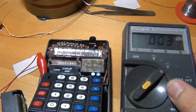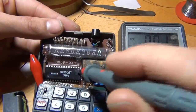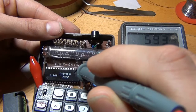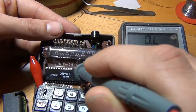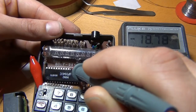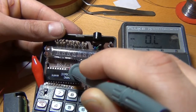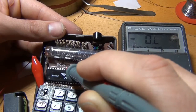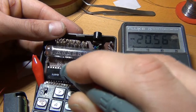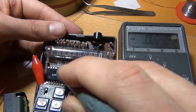Let's see the measurements. This one: 4 volts. This one: 5.9 volts. This one: 5 volts. This one: 5 volts. This one: 18 volts. Minus 18 volts. This one: minus 20 volts. As you can see, the chip has a built-in driver for the screen, so all of them are minus 20.